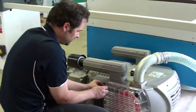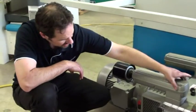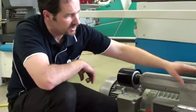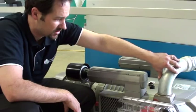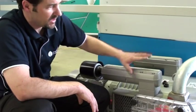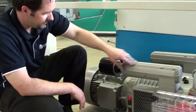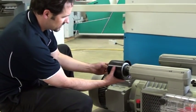The external filter is this one here. Basically, you can see there are two ports going into the internal of the pump. When the valve on the bed is activated, you're obviously sucking through this pipe here, which is the vacuum underneath the sheet on the table — we're talking about a nesting table here. When it's not sucking through the table, in other words the pump is running but the vacuum is not activated through the valve, it's sucking generally from atmosphere. That's why they have this snorkel filter on here.